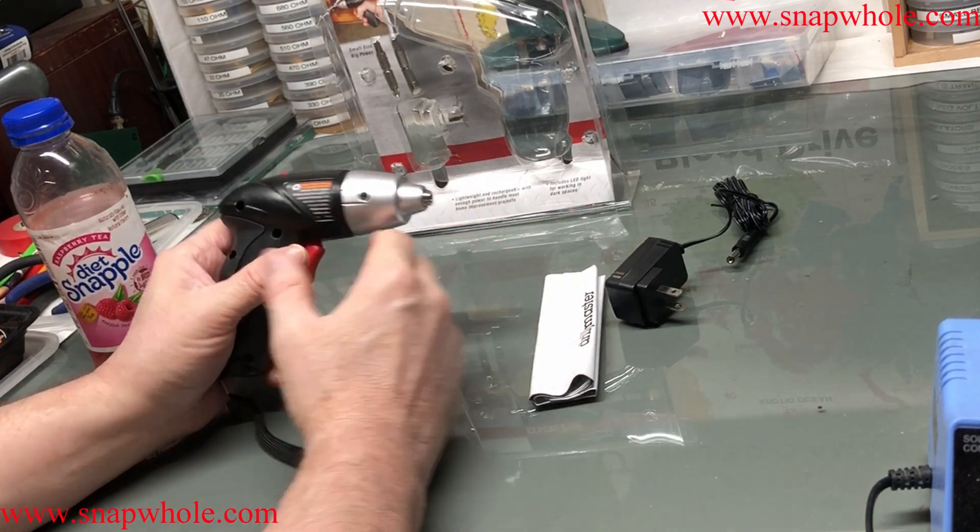It has a charger — the charger should be seven volts — and there is the charging port. It comes fully charged and contains a NiCad battery, so you need to know how to use NiCad. You should let it run down all the way, then plug it in for about six hours and disconnect it after that. If you leave a NiCad battery on the charger after it's fully charged, it starts degrading performance. And if you charge it before it's fully run down, the battery will develop a memory that prevents full performance — it won't fully discharge or charge in the future.